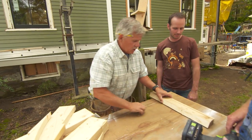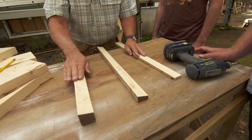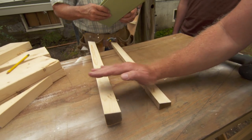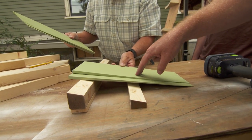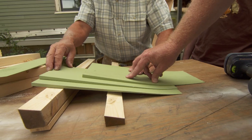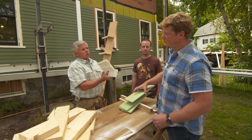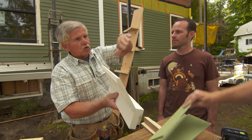You press shingles into the filler. The starter course always hangs down lower, the first course goes on with joints not lining up, and you push down with the filler set so your nailing goes through it. Each subsequent course goes on top, pushed down, depending on your reveal — and you've built your flare. But the architect wants to celebrate this transition with a crown molding detail right where the shingles end before the clapboards start, so the flare rolls up the wall nicely. We're doing this differently using curved studs mounted 16 on center on a piece of plywood.